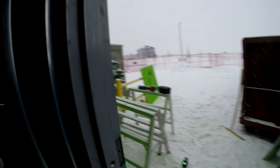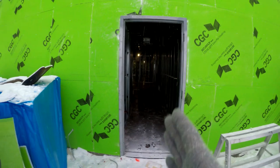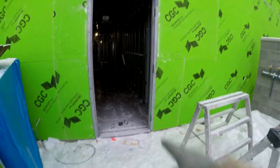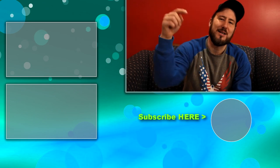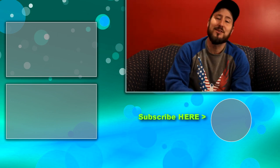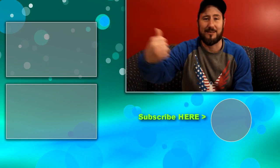As long as your walls are straight, your door frames will be fine. Always use a laser to level your doors on the hinge side, and make sure the elevation is also level. If you need to shim up the bottoms, do that before you pin them down. If you're new to Chris Home Blogs, make sure you subscribe down below and hit that bell notification icon so you don't miss when I go live every single Sunday morning and now Tuesday evenings.